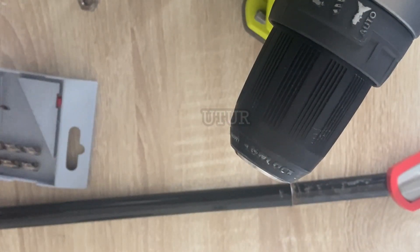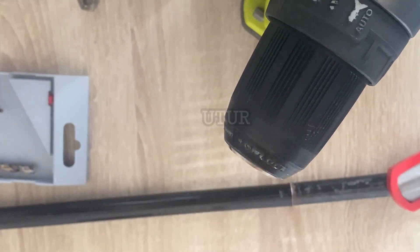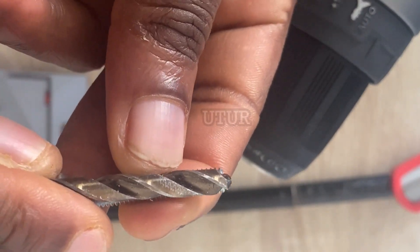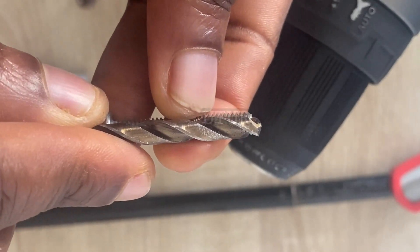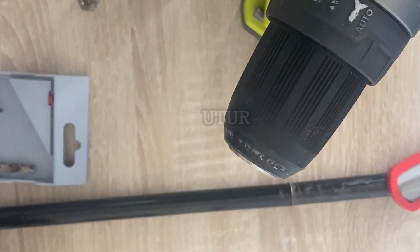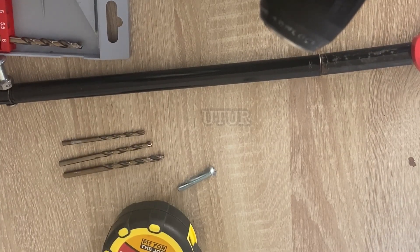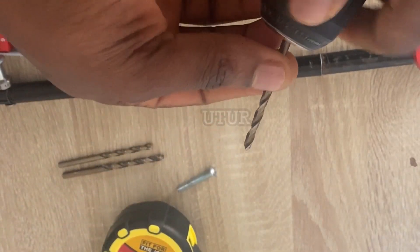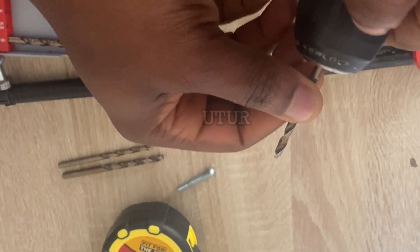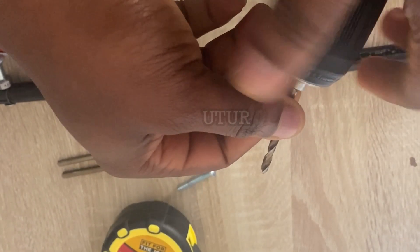From this visual inspection, I know I will be getting a tight fit through both connecting rods. If the drill bit is larger than the 6mm threading profile, you will get a loose fit. In terms of drill bit selection, I have a cobalt drill here, which is used for drilling through metals and cold rolled steel. Do not use high-speed steel bits or wood bits to drill through cold rolled steel or metal — selecting the appropriate drill bit material type is crucial.